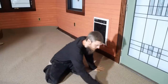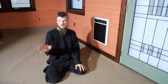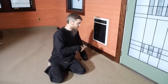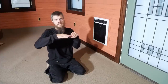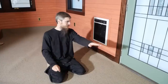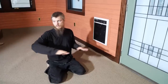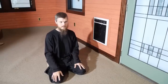I have the carpet more or less straight along this back wall and pretty smooth. I'm going to take a tucking tool and start tucking it under the baseboard. Remember, I said we left 3/8 of an inch underneath all of our trim, so now I have a spot to wedge that. In doing that, it's going to be under the baseboard, coming up and grabbing that tackless strip that we put down. Those nails on that strip are going to hold the carpet. Once we get this whole wall tucked and smooth, we can start pulling off of this strip. This is going to grip the carpet, and we can start stretching and smoothing out from the middle. And I think it's going to go okay. Hopefully I have it even enough that I can just tuck it under the trim and get going.